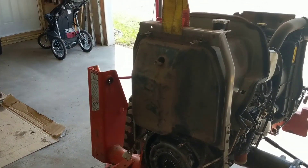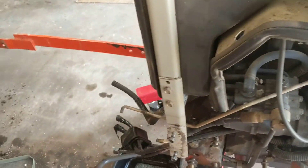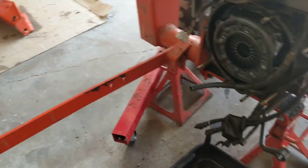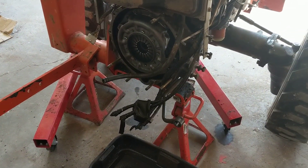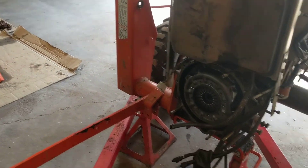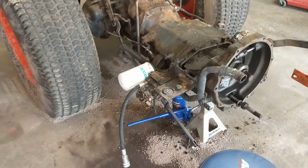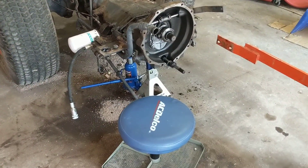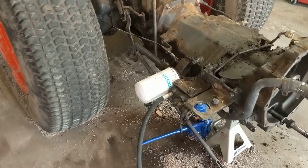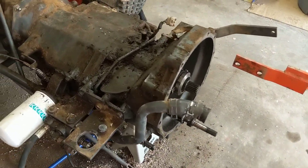The other thing is, if you read the service manual, it tells you to lift it from the fuel frame assembly. But once you get it out and try to jack it up, there's not much to put jacks under. That's where it was nice to leave half of the loader frame on — you have a safe place to put jack stands under the rear half of the tractor. I use a bottle jack to keep it where it needs to be, with jack stands under there for safety as well.